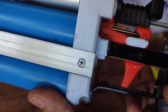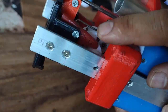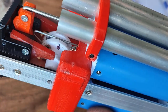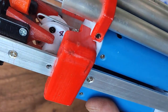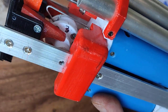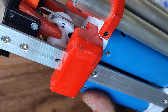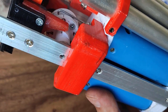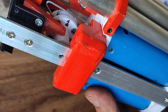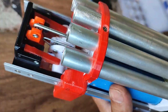The trigger has a rod that goes all the way through, so whenever you pull the trigger, that's what happens. It rotates the rotor and thus releases the catch one by one. The sequence is: one, four, two, three, one. The sequence is unusual, but that's how it is.